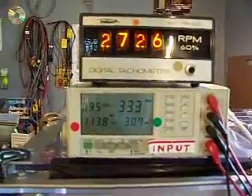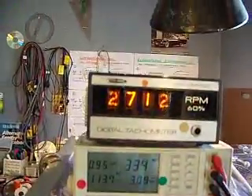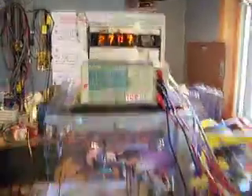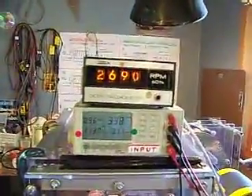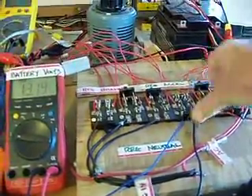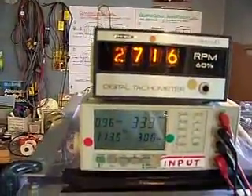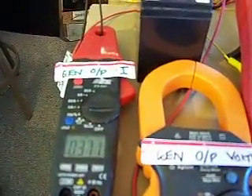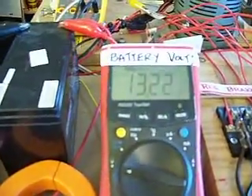So now I've put the conventional coil on, the induction motor responds, the system decelerates, the current to the battery is charging, and system deceleration is occurring. Now the regenerative acceleration coil — acceleration, current to the motor going down, current to the battery going up, and the battery is getting regenerative energy as the system enters regenerative acceleration mode.